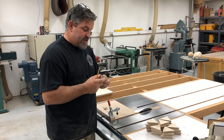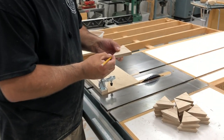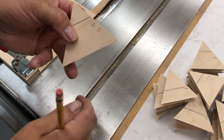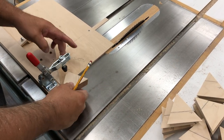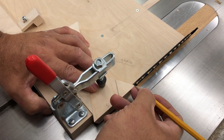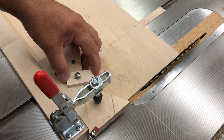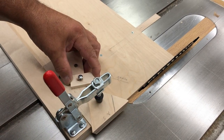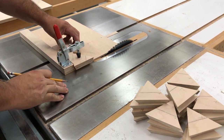All of our triangles now have a finished cut on two sides and they all turned out pretty good. On my second cut on this one I kind of broke the corner off, so I took another cut to clean it up — I marked it with an S meaning it's a little bit shorter. I'm going to use it to set my stop, and then all the rest of them should be a little bit longer and should clean up okay. So I'm going to use the shortest one I have to set my stop — basically lock it down, do my test cuts until I get a nice clean cut, then leave it locked down. I'll put the stop on there and cut the other 21 based on that stop, so they should all be exactly the same length on the sides. The most important thing is they all match in length — it doesn't really matter what that exact length is as long as it's close.